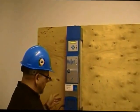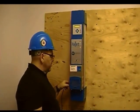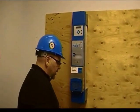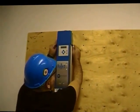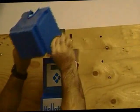Once you enter that, it's going to prompt you to unplug the unit and replace your UV lamps. At this point, we will take the power cord from your bottom left-hand portion of the unit and remove it from the UV system. Next, we're going to remove the top plastic cover from this particular unit. To remove the cover, we'll simply pull both sides outwards and lift it off.